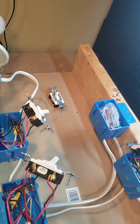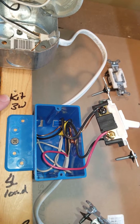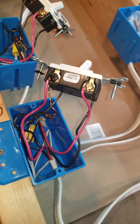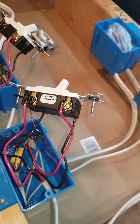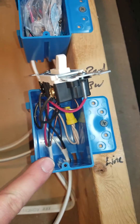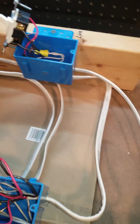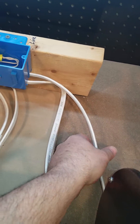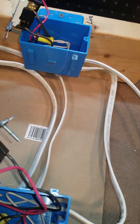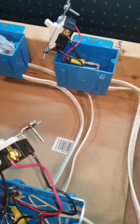You could easily have four switches controlling the lights in the kitchen. My example is for lights on the back porch: a three-way switch labeled as the kitchen going out to the back porch, two boxes in the living room — maybe you have French doors or sliding glass doors going out to the back porch — one on each side, and maybe a fourth one in a bedroom going out to the back porch. I'm using 14-gauge wire. I like to use 14-gauge slash 15-amp circuits on lighting circuits and 20-amp number 12-gauge wire on outlets unless otherwise stated in the plans.